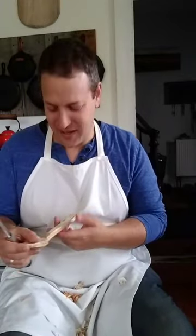Alright, so you can see at this stage, all I was doing essentially was cleaning up all the faces, getting underneath any axe marks so that I see what I have, and everything is a little more delicate so that when I go to make my next cuts, once I've redrawn the shape, everything is just easier to cut and it's easier for me to get a sweet line. But I didn't mess around too much with getting things perfect or even the right dimensions. I'm just dressing up the faces so I see what I have, and I can respond to that at this point. Because if I mess around more, A, I'm not necessarily speeding up the process, and B, I might remove material that I would regret later on having removed.